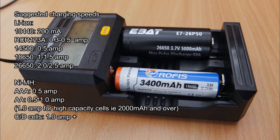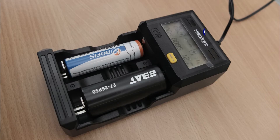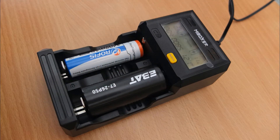These are my suggested charging speeds for lithium-ion and nickel metal hydride — only a rough guide. Time to come to conclusions: in most areas they've done a very nice job on this charger. You have a lot of functionality including fast charging speeds, but you can also adjust down very low. Termination was very good on both nickel metal hydride and lithium-ion, using delta-V for the nickel cells. A couple of small points: it's fairly large for a dual-cell charger, it doesn't support lithium iron phosphate, and the USB power output and display capacity reporting have some limitations, but these are minor points overall. A very solid charger, particularly interesting for those who use a lot of high-capacity large cells and want good charging speed.